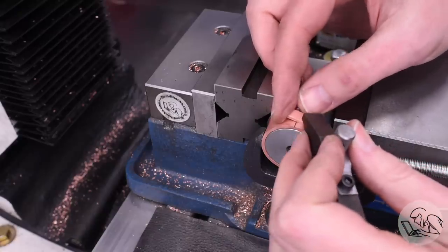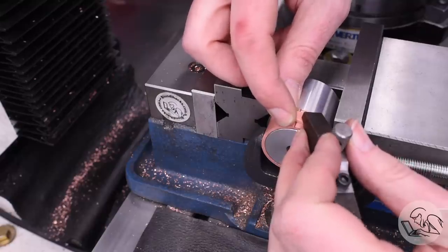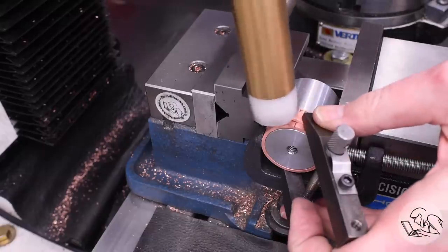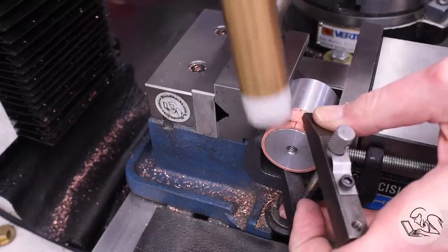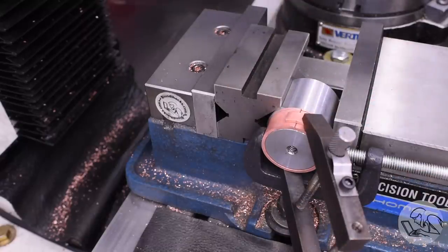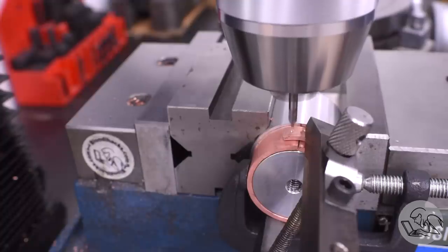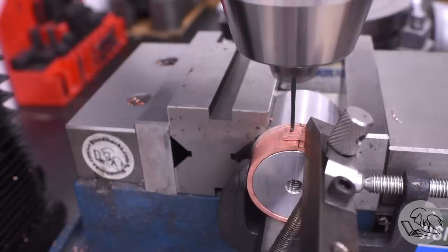I'm going to clamp the ring to it, and then I cut and machined to dimension this little strap here, and then I'm going to clamp that in place centered on the ring, and then I can hammer that over into shape there. So you can see how this fire door is made. It's a ring that has a tiny little riveted strap across the top of it. Then from this position, I can drill the rivet holes straight through on both matching parts here.